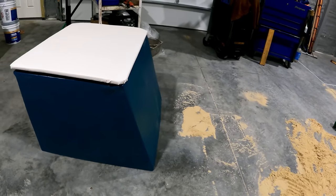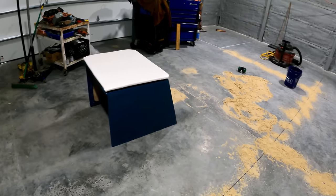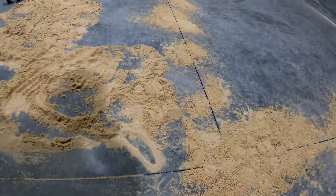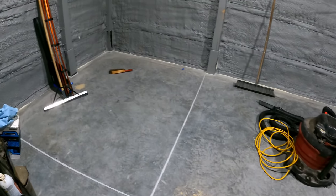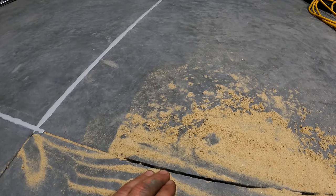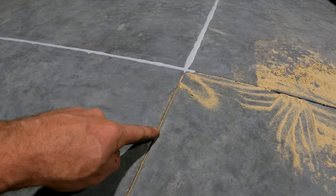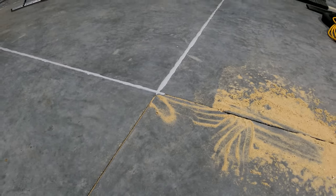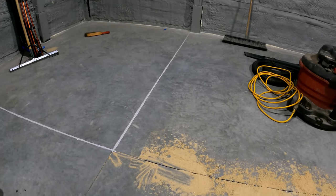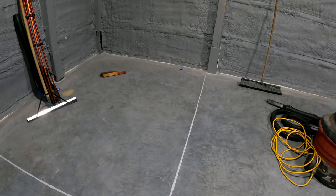Jen's got her boat cover box — she covered it with material that was about $5 a yard, real cheap, and recycled foam from the attic. You might notice the piles of sand — I'm just drying this sand out so it can get pushed into the relief joints easily. I'm using Sikaflex, a self-leveling sealant on the concrete joints. It's really important to put a backer in the crack first — otherwise you fill the whole inch and waste a ton of material. I push sand in, run the broom, and leave a nice eighth-to-quarter-inch depth. Inside it's definitely not a problem, and it's the same method I used on my driveway 10 years ago.